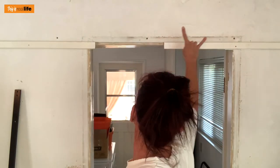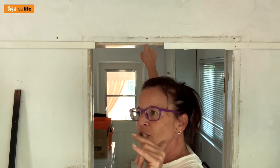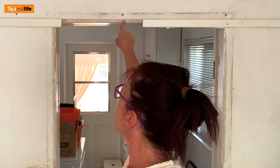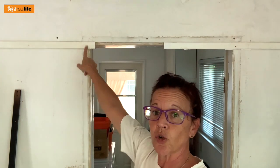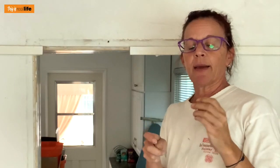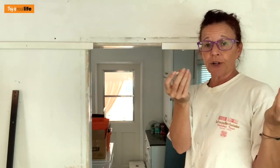So there's part of me that wants to put 2 here because I'm a little bit unsure. I felt tension, but I didn't feel like a stud's worth of tension. So I might put the 2 plastic molly bolts that came in the kit in these 2 holes, and then my 2 super industrial metal molly bolts that did not come in the kit in these 2 holes. Because this door is heavy, man. Better safe than sorry. Like I said, my kit came with these 2 white plastic molly bolts. They kind of aren't worth much, really, but I use them all the time.